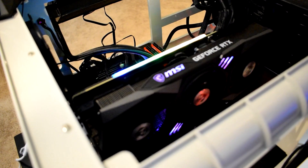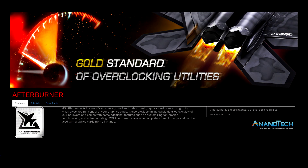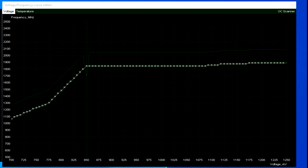Also, if you guys want to see my full in-depth reviews for both of these graphics cards, links for those will be also there as well. Undervolting these GPUs was fairly straightforward and only took me a few minutes to set up using MSI Afterburner. In MSI Afterburner, the voltage frequency curve editor was used, and for both the GPUs I targeted a voltage of 850mV with the frequency set at around 1850MHz, which was close to the advertised stock specification for both the RTX 3080 and 3060 Ti Gaming X Trio models.